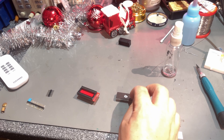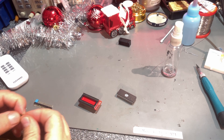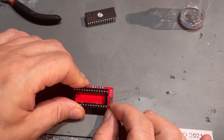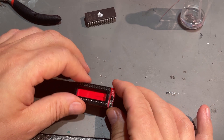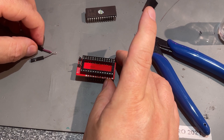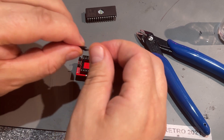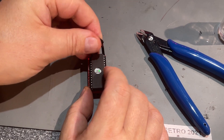It's probably the last block that is being used. We can fix that by adding a jumper and setting it to use the other block. To fix it I need to short between switch S13 and ground. I make a small jumper cable using two pin headers to bridge those two points together. I could have burned another EEPROM but I didn't want to waste this one.